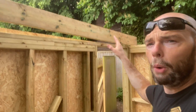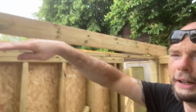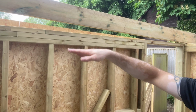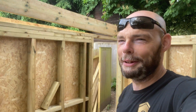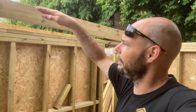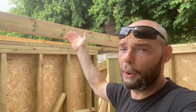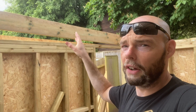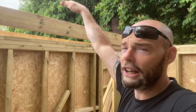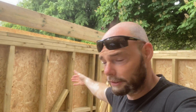When you put them up, what you ideally want is it to be bowing in that direction at the top, okay? Not the convex, concave one, you know what I mean? Because it's minor stuff, okay? But it creates a little dip in the roof, which can then allow water to pool, right? So if you just happen to give it a good look over, figure out which side is the proud side, the bit that goes up, stick that on the top edge, then water will naturally fall off of it. And that's simple stuff. It's just these little bits and pieces, isn't it?